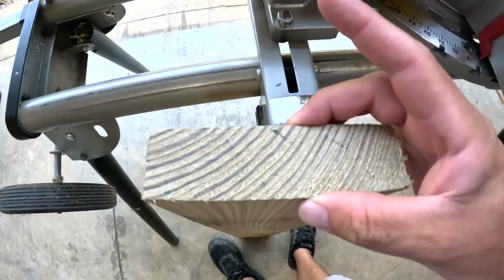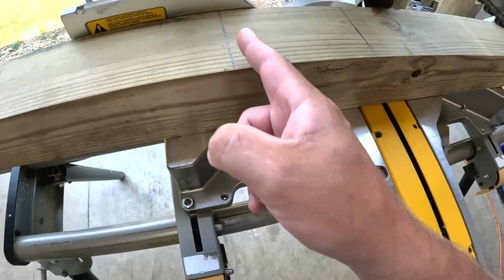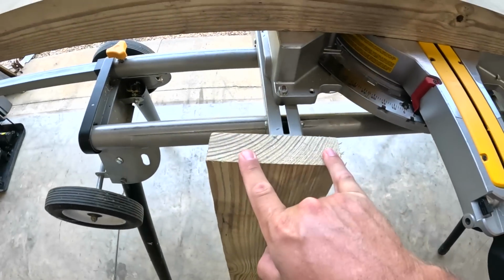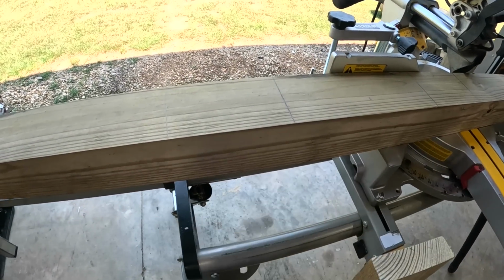because that's the thickness of my 2x6s right here. They're 1.5 inches thick. And I want to make a bunch of cuts across and then knock all the cuts out, clean it up, and I'm going to do the same thing over here because we're going to lay this piece down into the wood so everything is nice and flat across the top.